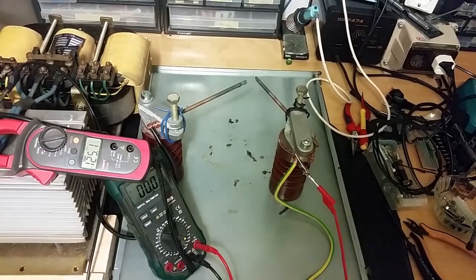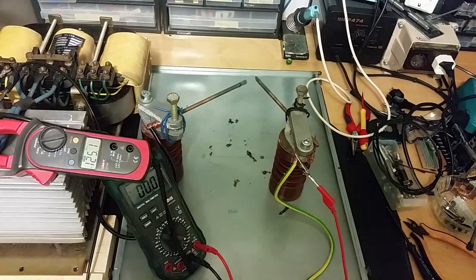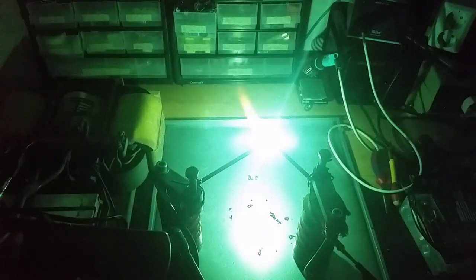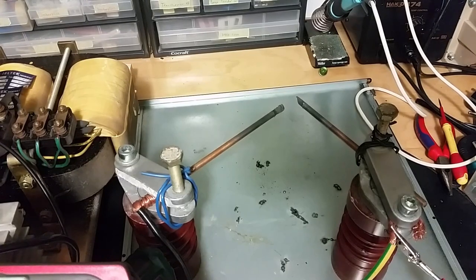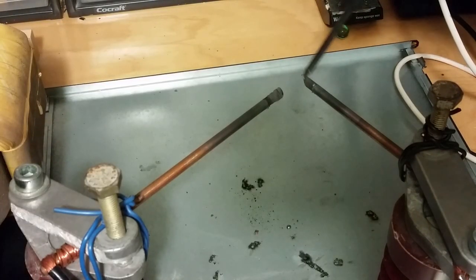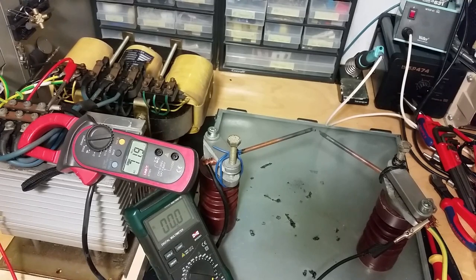Very loud. 125 amps maximum current. That's a peak power of 625 watts — it has a pretty bright light. Now I got a welding glass in front of the camera. So with 3-phase we got 3 times more fun. We are losing material from the positive terminal here, and we are depositing on the negative here. This was a pretty bright arc lamp.